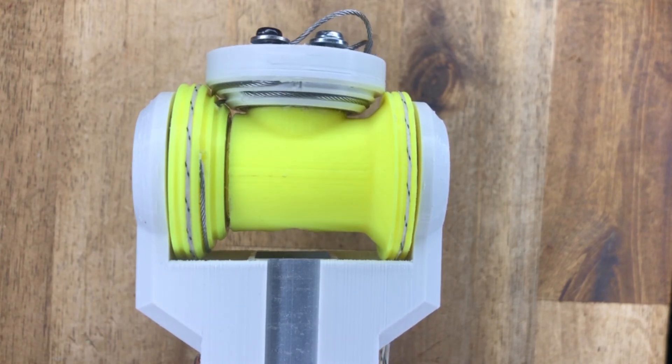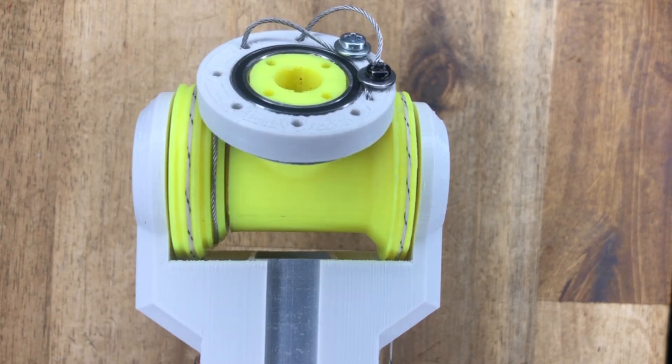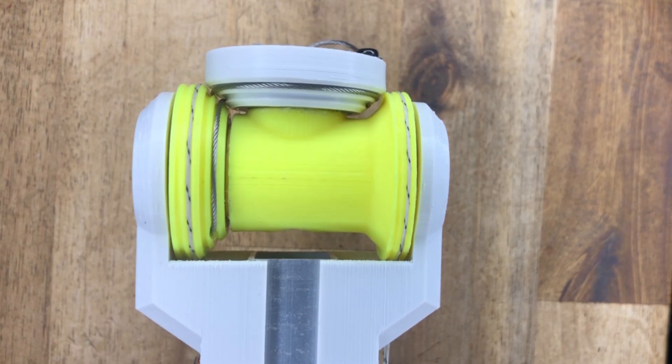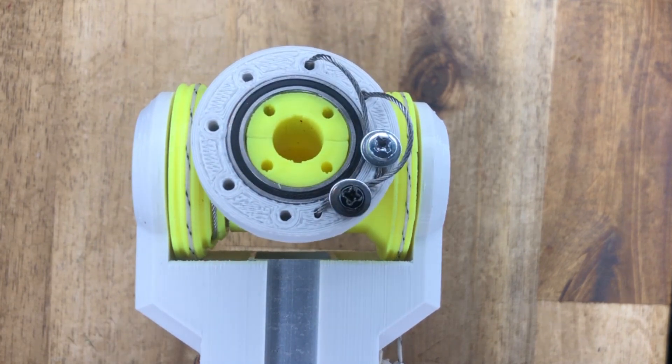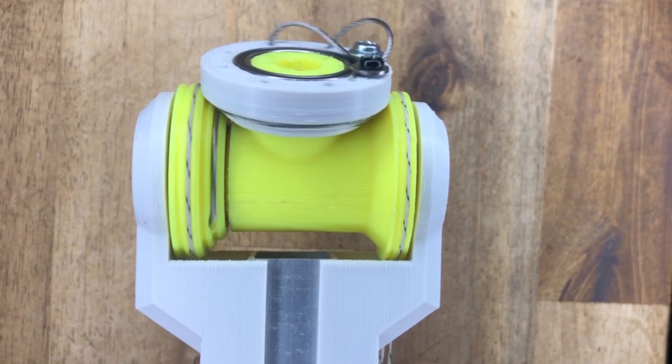Hello Robot Makers, Paul Gould here with my take on the robot wrist design by the University of Delaware. It is a semi-differential wrist where only the first joint is coupled and the second joint is independent. This reduces part count and cable routing. It has zero backlash but it is a bit crunchy.